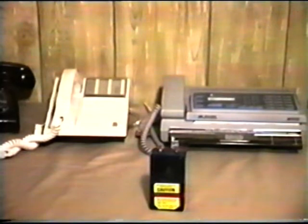If, however, a coin return tone is sent down the line, shortly before the initial 3-minute time period is up, the nickel that the phone phreak deposited at the pay telephone will be returned to him. As I stated before, however, the called party must produce the green box tones. The green box tones cannot be produced at the pay telephone.